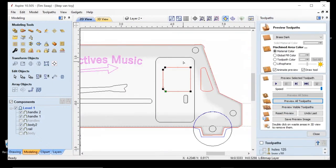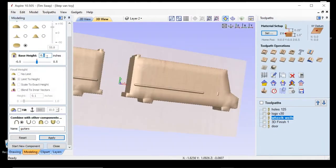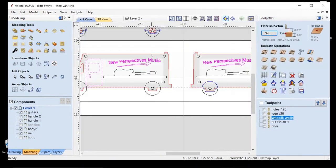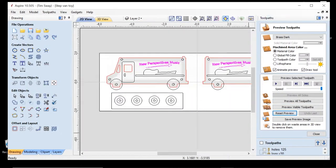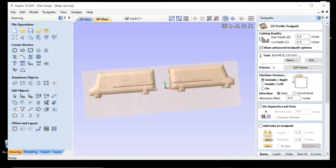On my first pass I decided to cut the wheels out of the same block of wood, which was about five inches by twelve inches by one inch thick. The whole truck becomes almost two inches thick when glued together, but the wheels only needed to be a half inch thick to fit in the wheel wells. So I removed a bunch of material from the wood first before cutting the wheels out to bring them down to a half inch. I did change that later and I'll show you what I came up with.